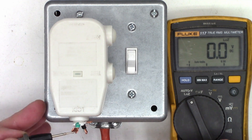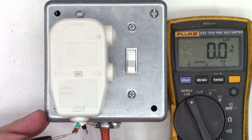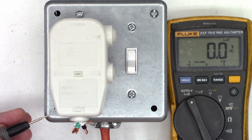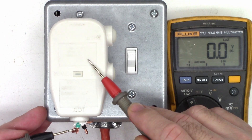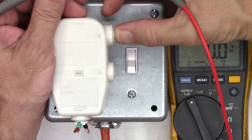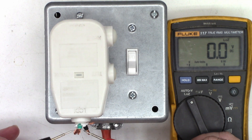Now I'm going to put this on the low impedance input. If I measure hot to neutral, I see 120 volts and there's no problem. But if I measure between hot and earth right now, it's going to trip my house GFCI breaker in my breaker panel. But if I measure between neutral and the sensing lead, it should trip this device only and not trip my house GFCI. If it trips the house GFCI, my video lights are going to go dark. So between neutral and the sensing lead — and it tripped the device. I now have no voltage on the output. Let's reset it. Hot to the sensing lead — and it tripped the device once again. There's no voltage on the output whatsoever.